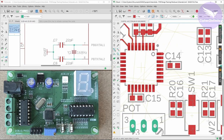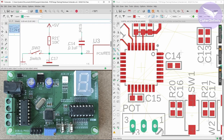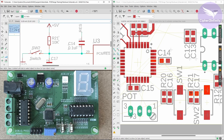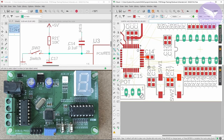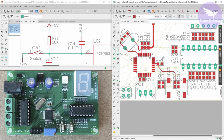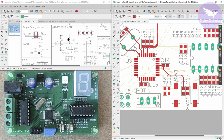This is basically the capacitor between the DTR pin and the reset pin. It will be connected like this — connected here and then going towards this particular section. Let me select the track and connect this directly here, and then do the connection towards this section. This is actually the reset pin; once we press the switch, the reset signal is going to travel like this towards this particular pin, and this pin will be connected to the ground. You can lay the track in any way because this signal is just an on/off signal. That's basically the reset pin capacitor; we are done with the controller section capacitors.